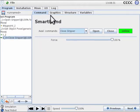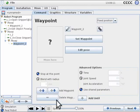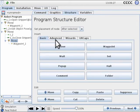Add another move command to move back to a safe position such as waypoint 1. Instead of going through the pull-down menu, locate the link symbol underneath the pull-down menu and select waypoint 1. Finally, add a second waypoint that will serve as a drop-off location.